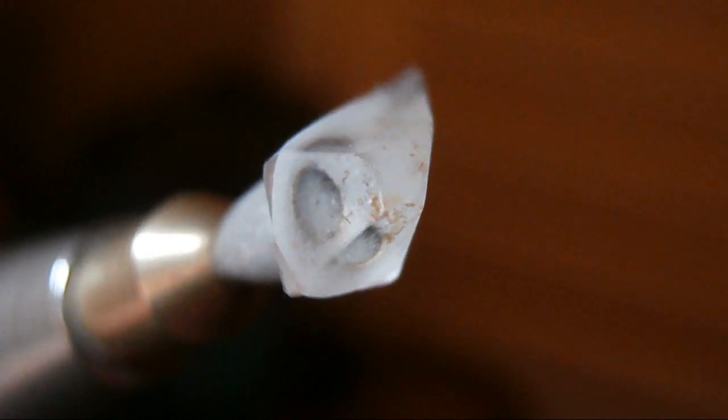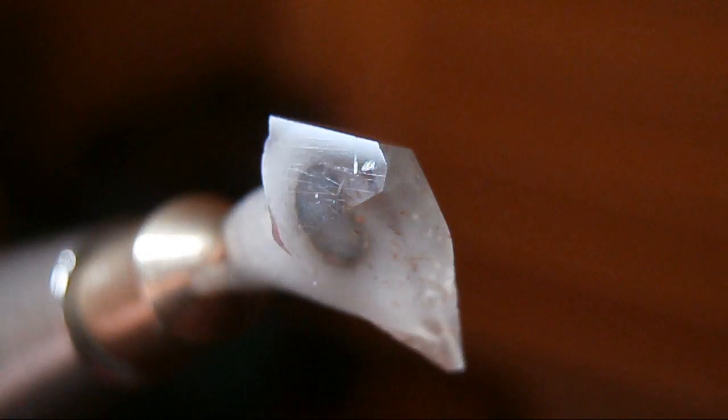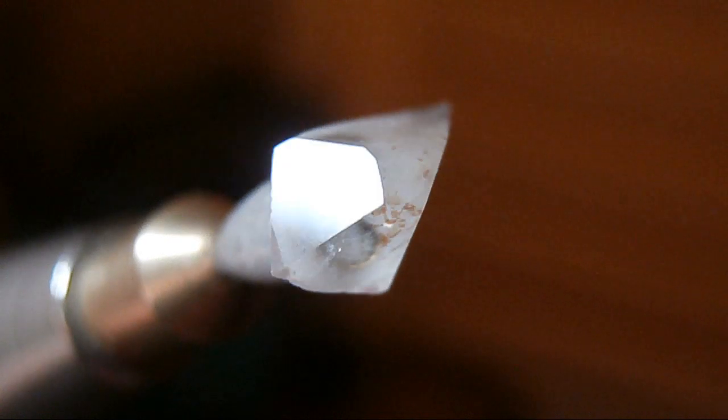So the Perspex with the 9000 diamond compound did a better job of removing scratches and polishing, but I'm still not happy because it's still leaving traces of scratches under high magnification, and also my 3000 grit pre-polish is dragging out scratches on the surface also.